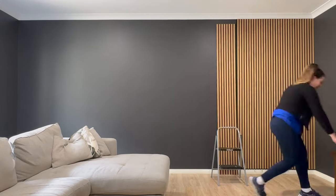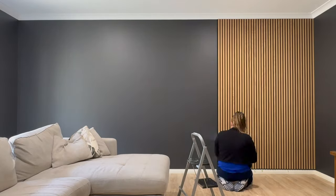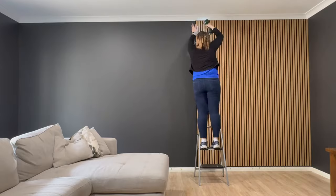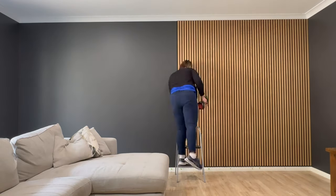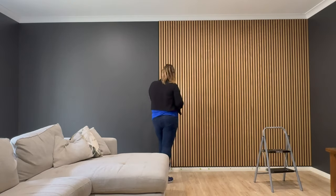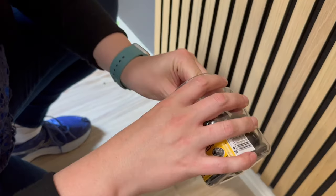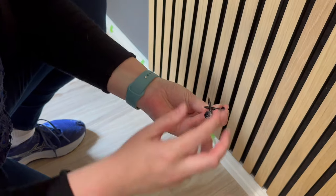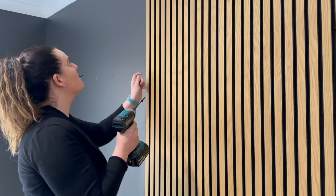As you can see, the process is really quite easy. I'm just picking up each panel and applying six screws per panel to hold it onto the wall. I was lucky that I didn't need to cut the panels down to size, but if you have a ceiling height where you need to trim the bottom of the panels, you'll need to use a jigsaw or a hand saw to cut them down before you start installing.